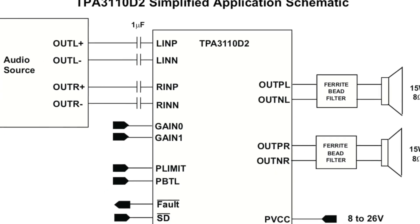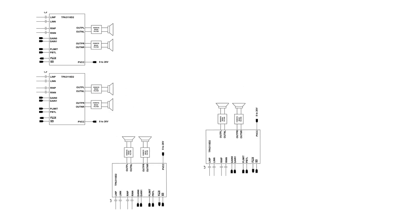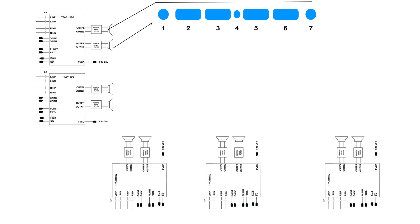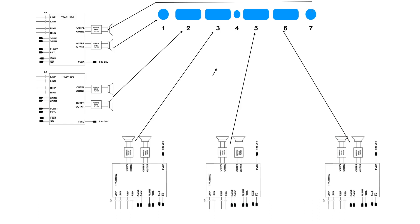I have a theory. Since each amplifier has two outputs, that gives 10 outputs total, but there are seven speakers. What I think is that they use one amplifier for the small round speakers and the other four amplifiers for the four rectangular speakers. That way they provide 15 watts to each round speaker and 30 watts to each rectangular speaker, so they can use them as full-range or as subwoofer drivers. There's also a small tweeter in the middle — I'm not sure if it has its own amplifier. The basic logic is: four amplifiers in bridge mode and one in stereo mode.